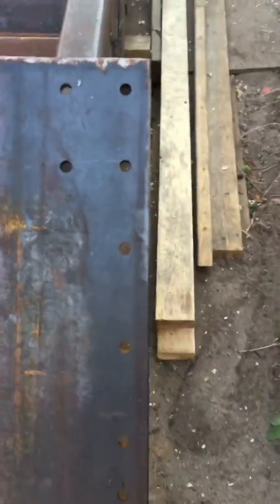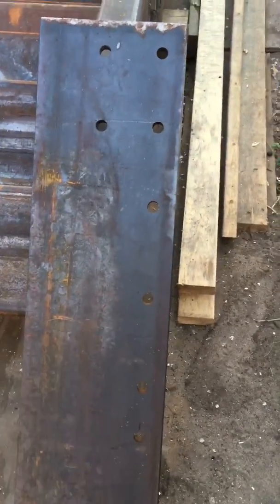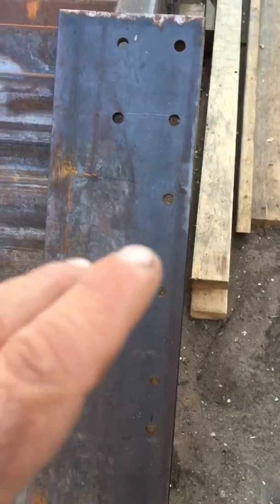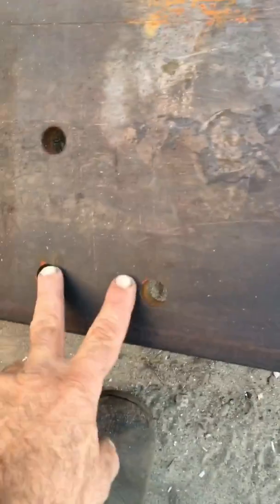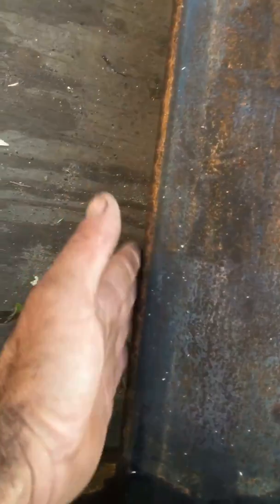This base plate sits on top of the platform — it actually bolts through everything: bolts through the base plate, bolts through the platform, bolts through the wide flange. That's why this pattern is a little closer, because that catches each 10-inch tube. This catches it and this catches it, so the platform starts at the very edge of this first step and goes this way.